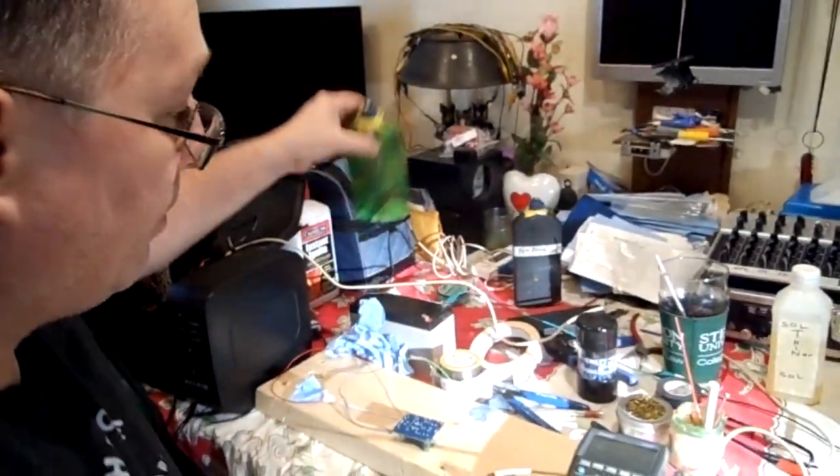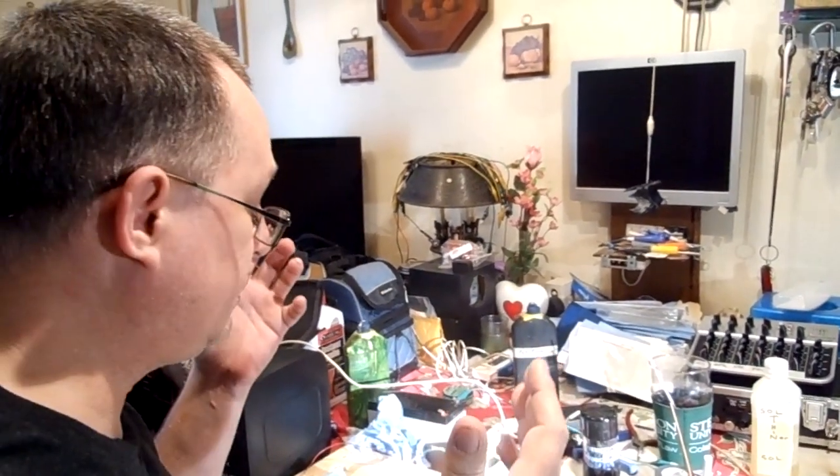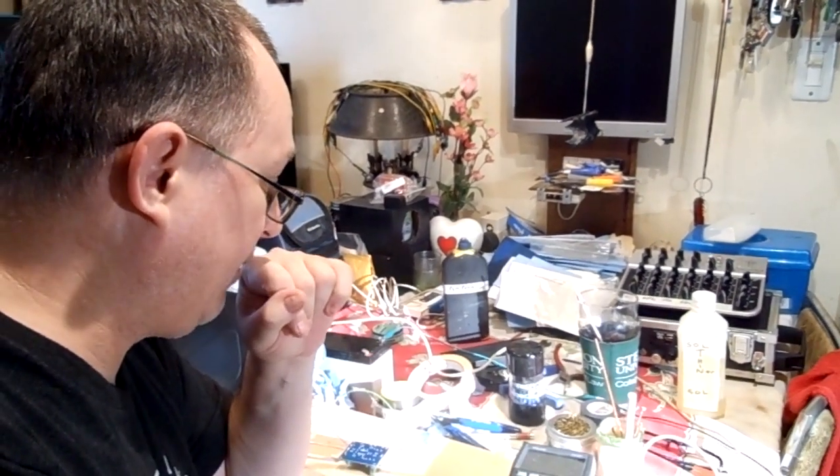But I do remove it. So it's an extra step. It's like, would you rather fight with this thing and get the board super hot, risk lifting a trace, spilling solder on your, if you're like me and you're wearing shorts, or would you rather take that extra time that you would be monkeying around, cooking the board, wasting solder, inhaling fumes, and apply a little flux and then have to remove it. So in that 1 to 3 seconds to apply it, 1 to 3 seconds to remove it, all that other time that you would have consumed fighting with the device to try to get the solder to stick.